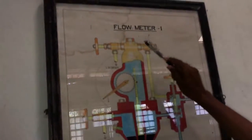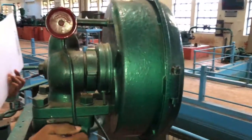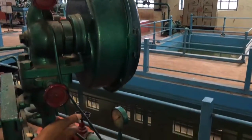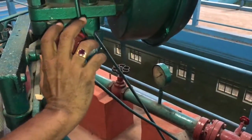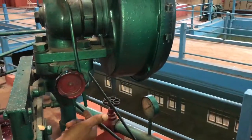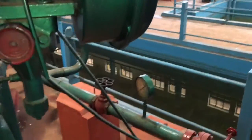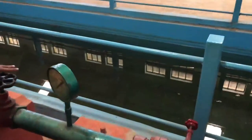Like in a centrifugal pump, there is an equalizer with a drain plug on the high-pressure and low-pressure sides. The equalizer is used to equalize pressure between the two sides. After starting, first open the low-pressure side to bleed any air until a continuous flow of water comes out, then close it. Repeat this for the high-pressure side.